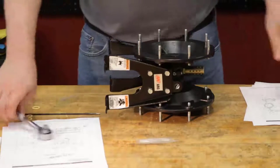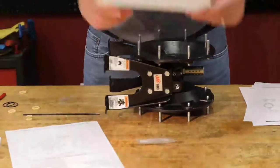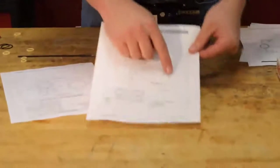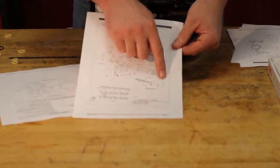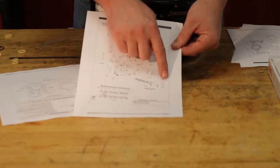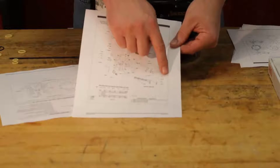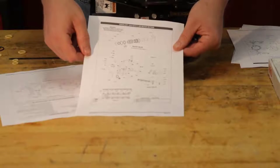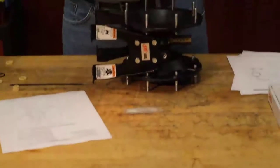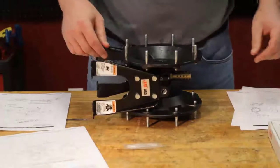I'm going to go ahead and look at my operator's manual to make sure that these do not have any type of torque requirements. So I am right here, item 123, which does give a square box, but with no identifier key telling me to torque. This box here calls out Loctite 572, which, again, as I mentioned, those screws already come with Loctite on them.